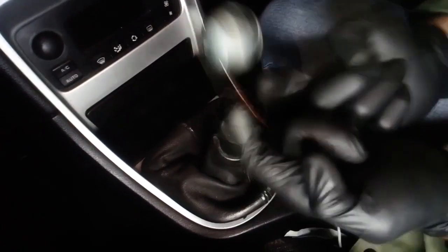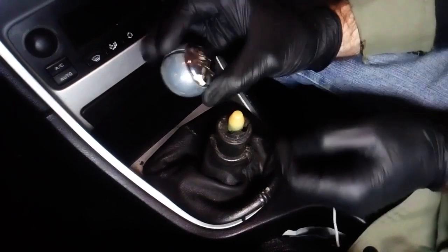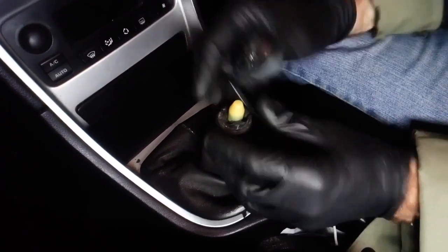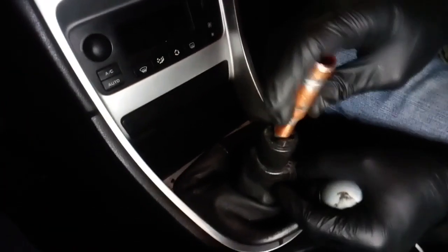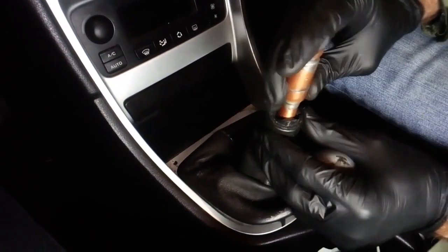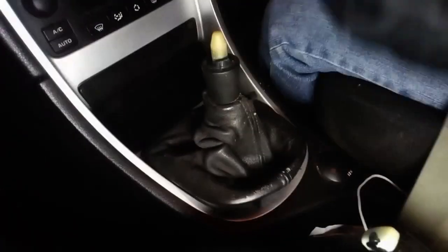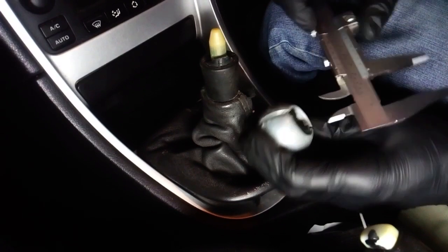So today we're dealing with another case of a destroyed gear stick knob, this time on a 2006 Peugeot 307. And this one is more severe since the whole head has snapped off from the neck. Go figure. However, this white plastic sleeve around the metal bar gave me an idea, and as we can see, a 15mm copper pipe fits nicely around that plastic sleeve.